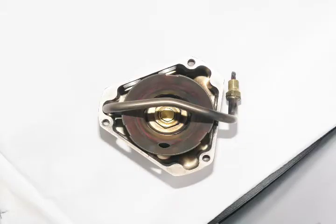One option I decided to try was to put a set of holes on the other side of the holes already installed in the housing, placing the legs so that the top and bottom parts were in line rather than offset as in the original design. The offset gives it springiness, but that springiness also provides a torque that under high heat conditions can cause the metal to deform.